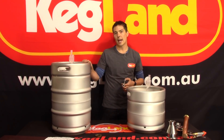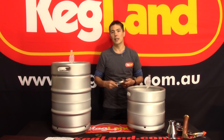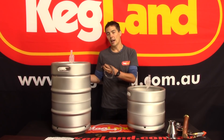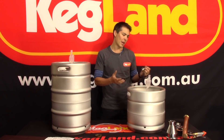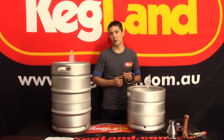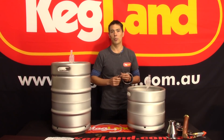When you first get these, you'll notice they are fully acid bath electrolysis passivated, so they're really well made. The keg industry has fairly high standards in pressure vessel manufacturing, so by using a product which already exists and just modifying it a little bit, we're able to get a really good value fermenter made out of thick, robust stainless steel. A lot of customers these days are getting into fermenting under pressure, and these are really one of the perfect vessels for that.